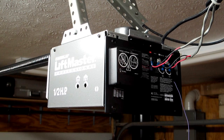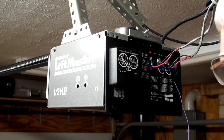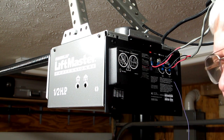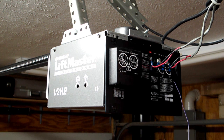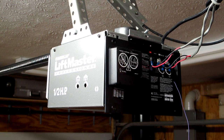You may be experiencing problems with your garage door opener similar to what I have. Sometimes the remote will open it, sometimes it will not. This is a metal insulated door. My house is wrapped with an aluminum foil back insulation and I have a metal roof. On a hot day, there's only a 50-50 chance the remote will open the door, even 10 feet away. On a cool, humid, or rainy day, the remote works perfectly, even 100 feet away.